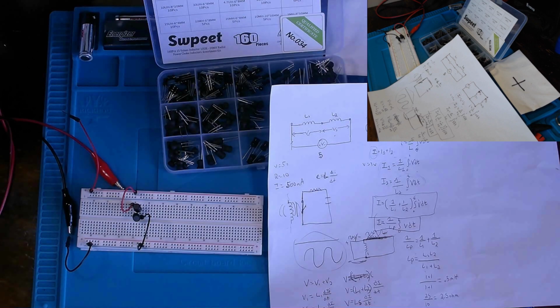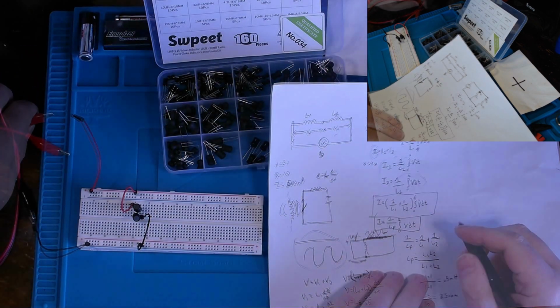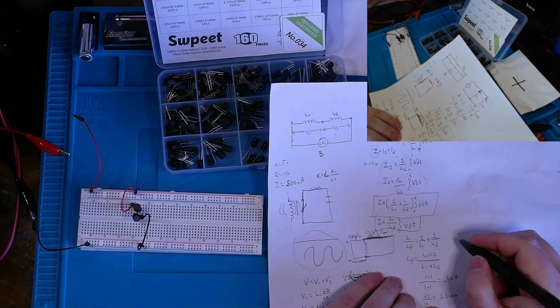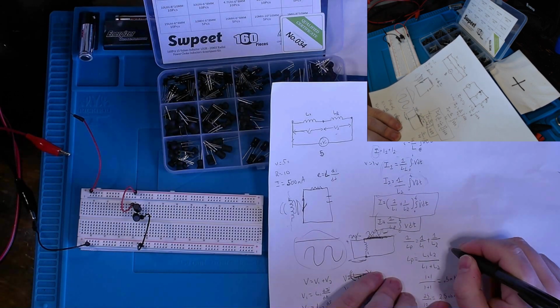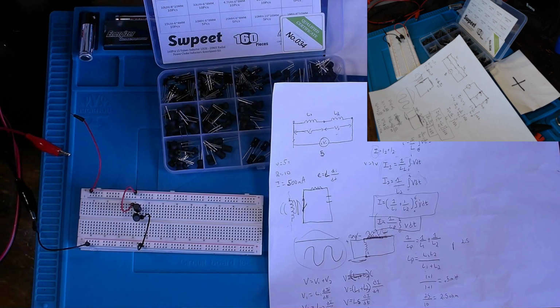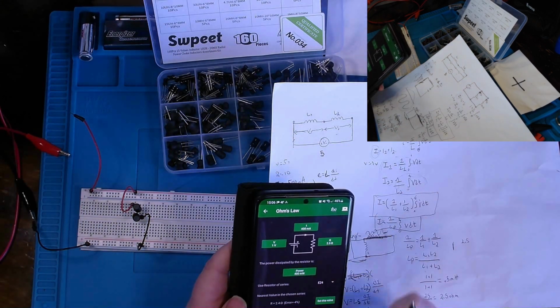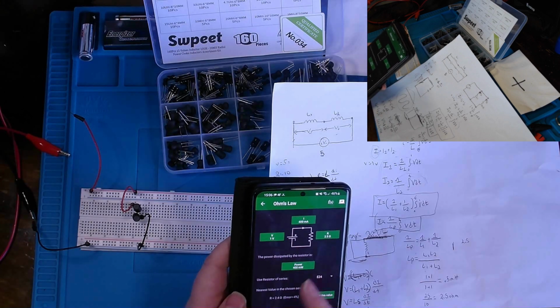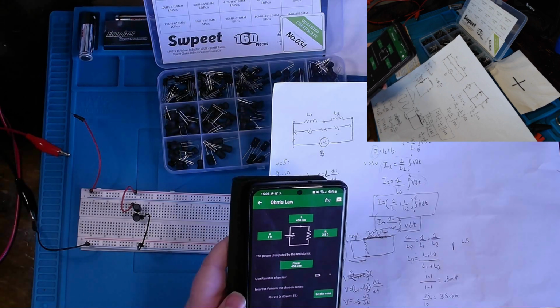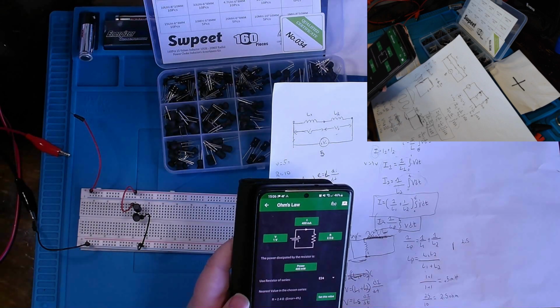And we could essentially say that if our voltage is 1 volt and our resistance is 2.5 ohms, then now I'll just go back to my cheater. Dual math versus cheating. Always choose cheating. But at 1 volt, we shouldn't see any more than 400 milliamps in circuit.